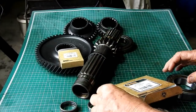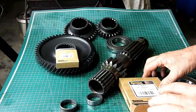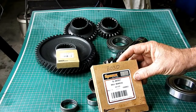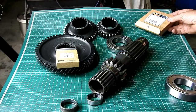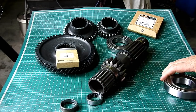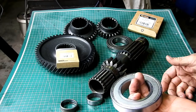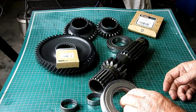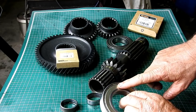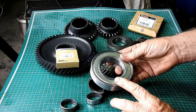All the needles are supported. On this other end, the bearing is an S40757 or a 6211ZZ. The original bearing was only shielded on one side; the new bearing is shielded on both sides. That's fine — there's no problem there at all. That'll last a million years like that. You can pop the shield out if you choose to and let the oil lubricate it — it's up to you.